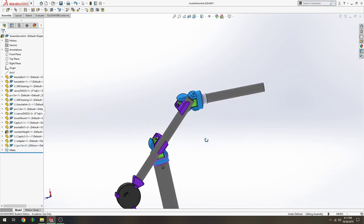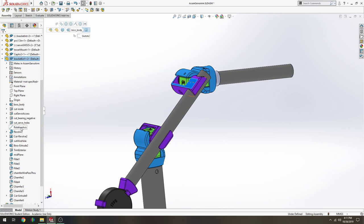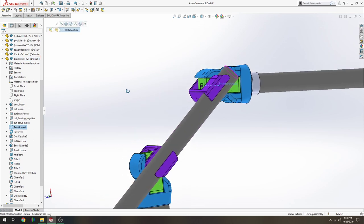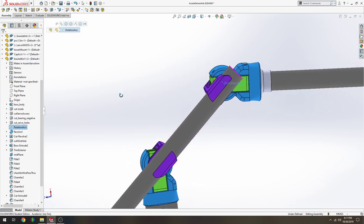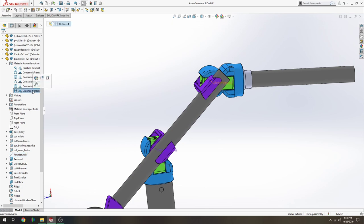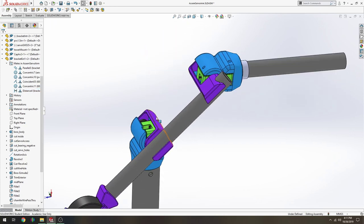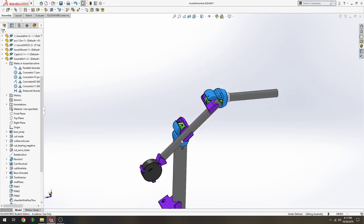And there's a couple of constraints in here that describe the system, such as this bracket has an axis, the rotation axis, describing the axis of that joint, and it's set to have a certain distance. This is 150 millimeters from this joint to this joint, just in case you want to use that for your kinematics. And of course, in real life, that depends on how you glue the purple parts to your PVC. So you can choose that if you want.